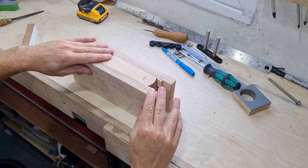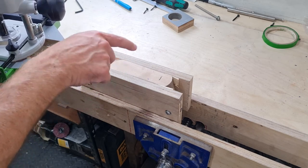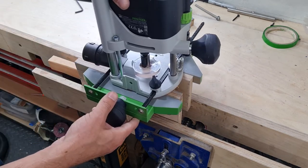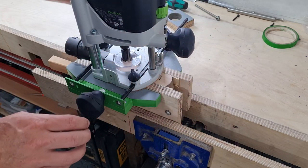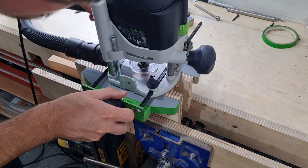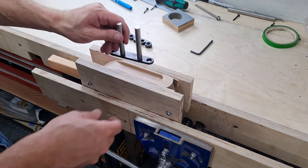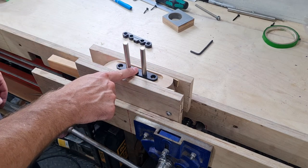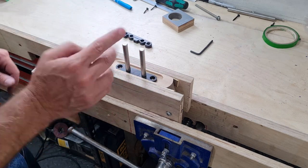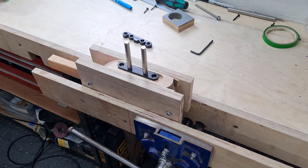That's about as near parallel as we're going to get the cheek piece to the guide boards. I've offset the router and I'm going to do a couple of passes coming in from the rear - not plunging like I did with the clamp section, but opening it up all the way from the back. A couple of passes up to my mark, down to depth, with the depth of the cutter matching the thickness of that top plate. We've got a nice wide slot there now.